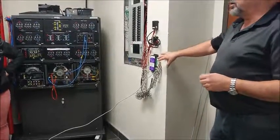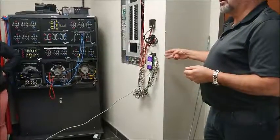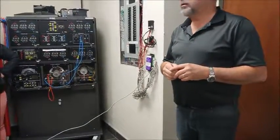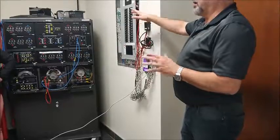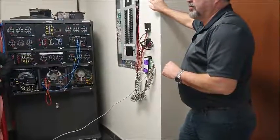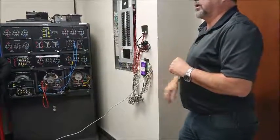If you buy one of these units and you want to hook it up to a Canadian voltage, you have to put little transformers out here to make that happen. It can happen. I'm going to discuss that in the lecture here in a minute. But no, we don't have them here, because this is not a 600 volt panel. I don't have to worry about it. The voltage coming into this panel is 208 volt. 120/208. Those are quite capable of doing that.